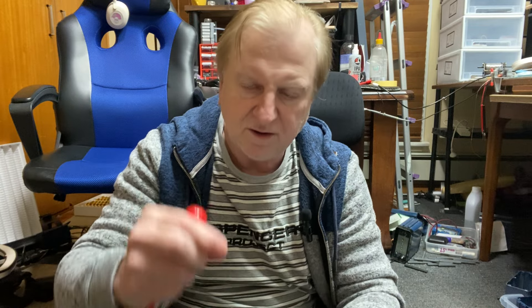We'll pull it apart and this could be a bit of a laugh as well. I've just seen so much in terms of serious detectors over a long period of time. That detector's drifted onto the mains frequency — if you can hear that. Even though these detectors don't move much in the short term — otherwise they'd make a horrible racket when you went detecting — in the long term they drift. It's just because they utilize an LC oscillator for generating their transmit and receive timings.